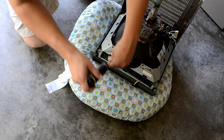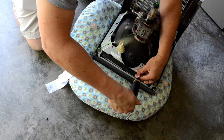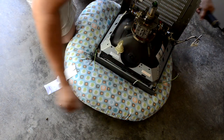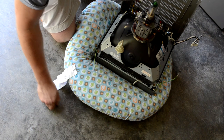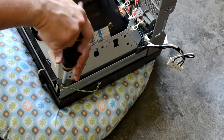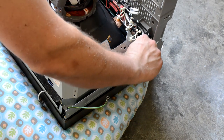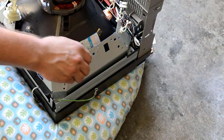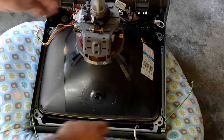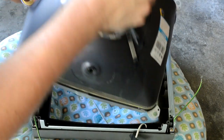I'm going to remove the remaining screws holding these ground loop cables onto the shielding, and then remove the bolts holding the shielding as well as the tube onto this bezel. Now that all the screws have been removed, I'm going to slowly pull off the shielding with the degaussing cable inside it. Make sure you don't impact that against the neck of the tube because it's very fragile in that area — if you bust the tube, it's ruined.